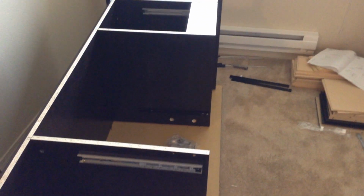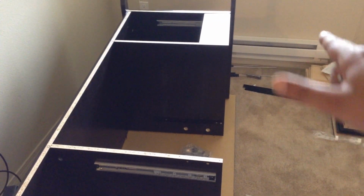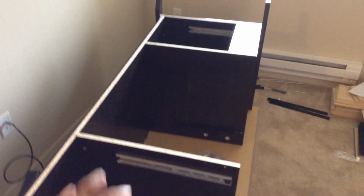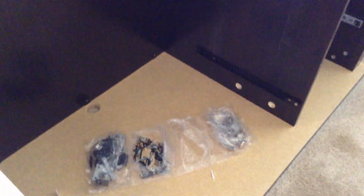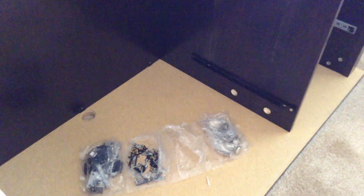But it's basically where we're going to be getting all of this set and square, and very carefully start at one end, kind of work our way to the other, and get this settled onto its top before we tighten any of them. Moving and wiggling this around so that these all settle in tight on their spots, okay? Now, if you're not 100% confident in your use of an impact driver or power tool, go ahead and do this with a hand screwdriver.